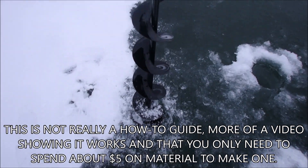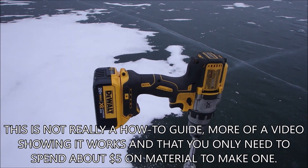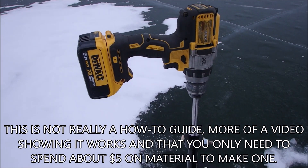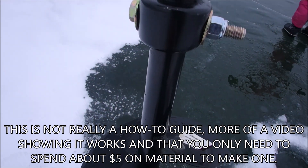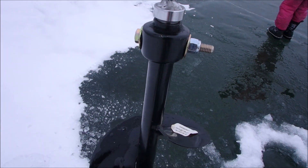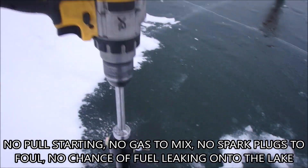The problem I had at home was the ice auger — it was old and had been sitting around for quite a while. So what I decided to do was just build a little adapter. It's half inch up there, and this Jiffy auger just happened to be 0.875 for the shaft going in here, so I just welded those two together.